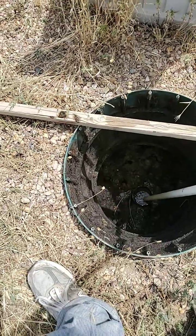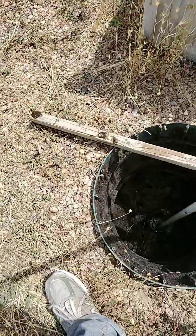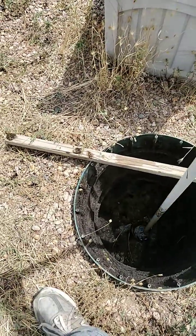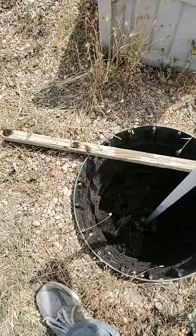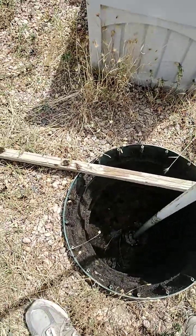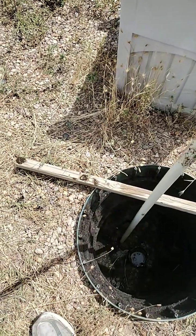This is the water level in the inlet baffle right here, which is where you want it to be. You want it full in this tank — you want things to kind of settle. And if I put my pipe down in here, I don't get any resistance at the bottom at all. It goes right to the bottom, so there's very little buildup.